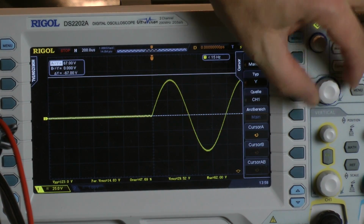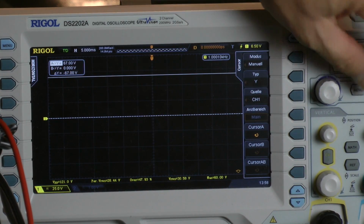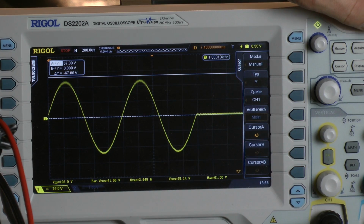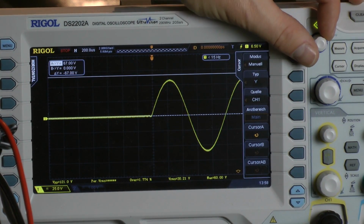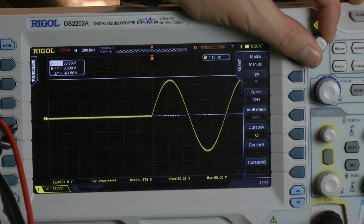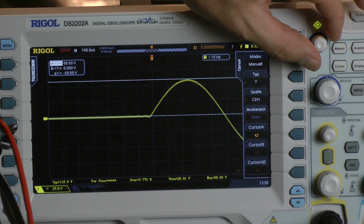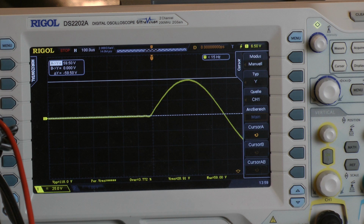First cycle. Looks very good. Jumping to the last cycle. It's also okay. Let's calculate with 59.5 volts. The amplifier puts out 885 watts, that's 442.5 watts, into a 1 ohm load per channel, both channels driven.